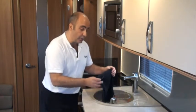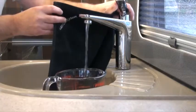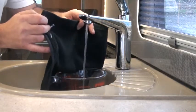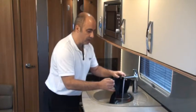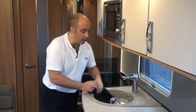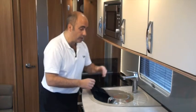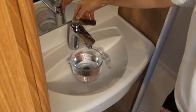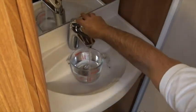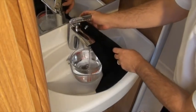This is where the cloth comes in — I'm going to try to stop bouncing the water around the place but also collect the water at the same time. You should hear Flow start again. It has now sensed that the pressure has dropped, so it's just topping it up. We've closed that tap off and, as you can see, we've got quite a sizeable amount of water out already. Now I'm going to turn the tap all the way to hot and do the same thing once it has built up in pressure again.